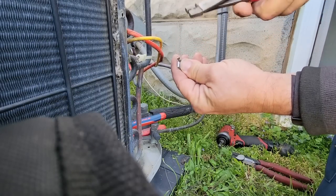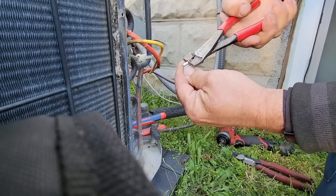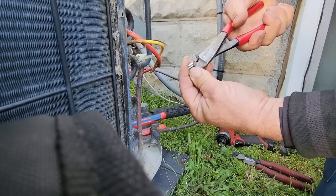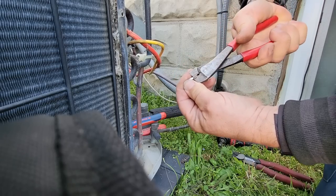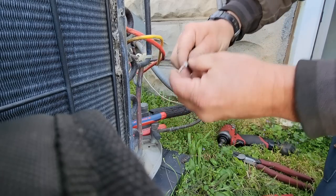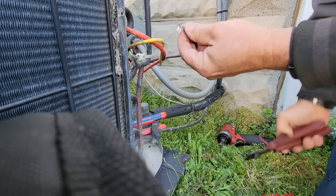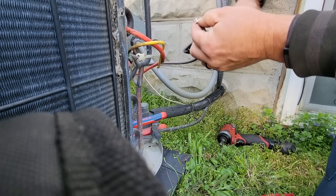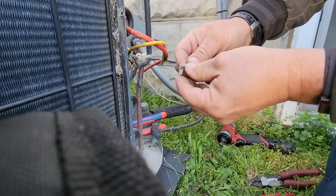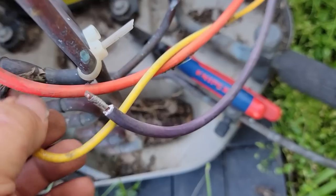Get that slit on there. Let's see how this does — going from the back side on this one, it kind of pinches it down like it should. Kind of rolls that barrel connector in there, gets a pretty good crimp on it. It's not coming off. We can trim the excess off like that — it's pretty tight there, does a pretty good crimp right there.